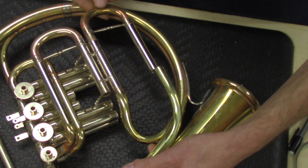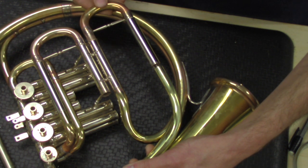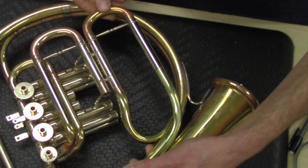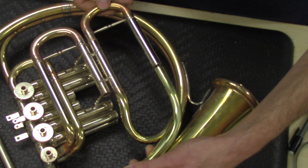For the second check, just like before, I'm going to hold the branch in place and slide the tuning slide over to make sure I don't feel any drag and that the branch doesn't move or flex as I slide it over the top. And there it is — sliding perfectly. So we're ready to solder in this branch. I'll do it in three different stages with a check after each one, just to make sure this angle doesn't move at all.